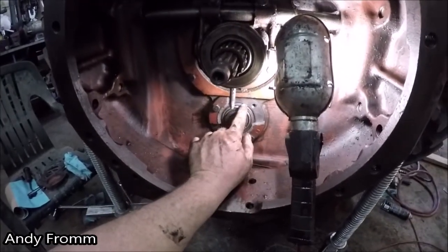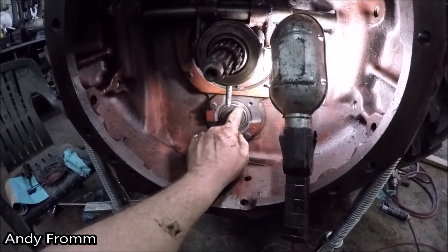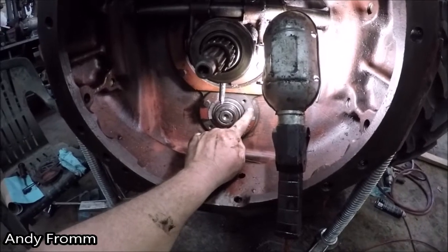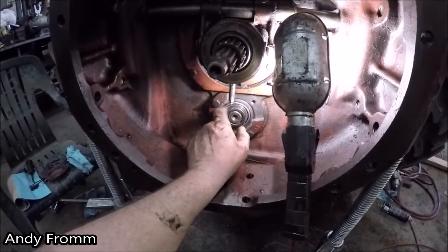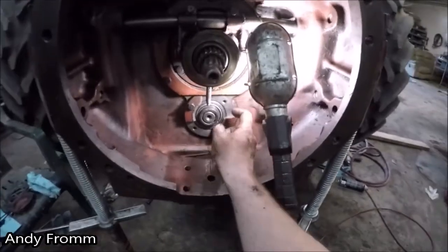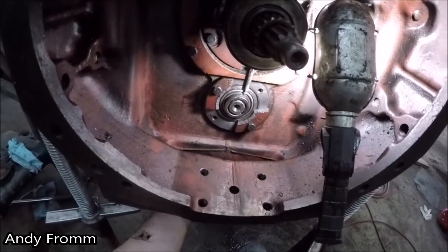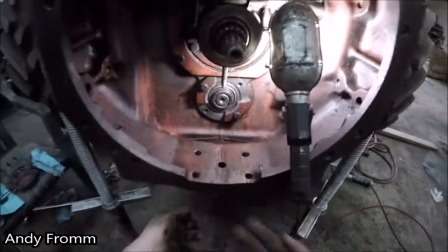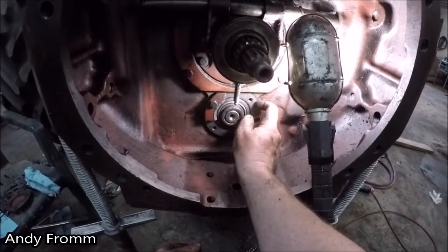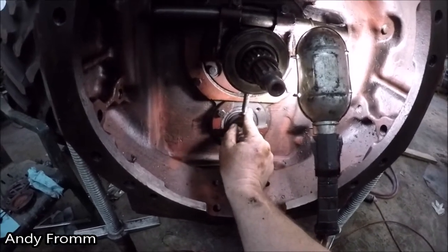and then I came back and I checked this, and where I had it with the 4 shims, the 2 thick and 2 thin, the gear was loose in here again. So I went and took all the shims out, went and snugged it up, and it preloaded the bearing. And so I put one of the thinnest shims in now, and I checked it. I can just barely move the bearing around if I stick like a pry bar in behind, up underneath on that gear. So, and I can see it wiggle a little bit on the shaft. The race isn't moving it any further.